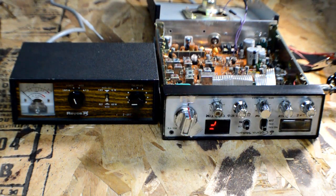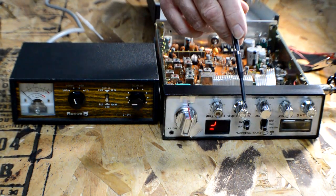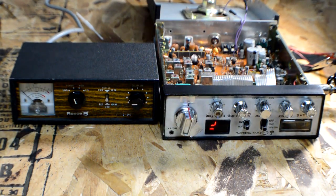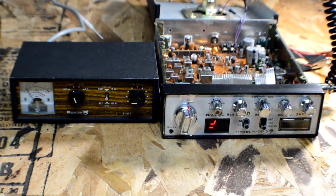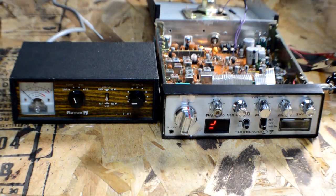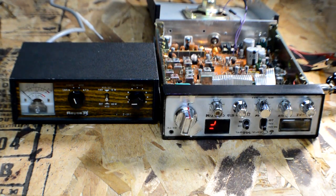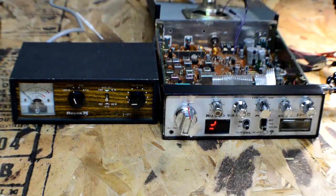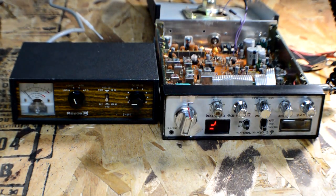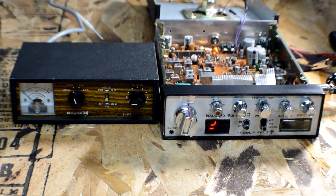Now that we got our modulation set and everything's looking good on AM, we're going to turn it over to sideband. I turned this switch over to sideband and turned this switch back to power. We're going to give you a little test here with the microphone and you can see the wattmeter. You saw the wattmeter move there but it didn't move very much. So we're going to make the adjustment which is VR6. We'll put the alignment tool down in here and turn VR6 up, then try that radio again. Now you can see we have plenty of power.